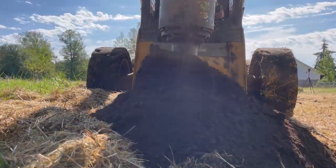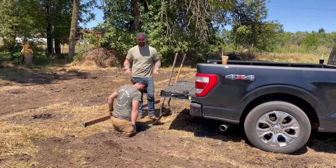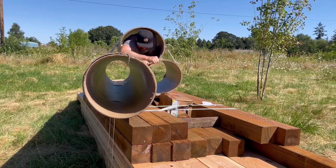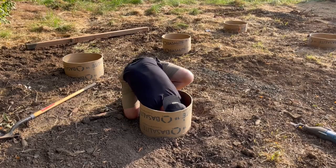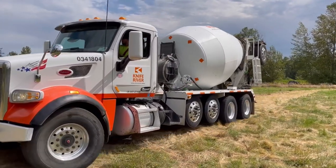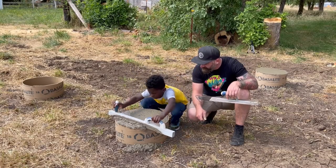They dug a bunch of 18-inch holes for footings — 18 inches wide and about 4 feet deep. Once they were dug, Jason filled the bottom with about a foot to a foot and a half of gravel and made Craig tamp it down with his feet. Then he got some sonotube and crawled through it to make sure there weren't any blockages, and had craft time in the shop building some cool things out of rebar. He stuck his head down in the bottom of a hole — it was a low point for him.